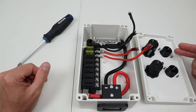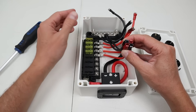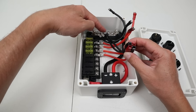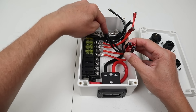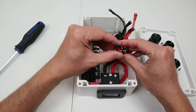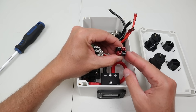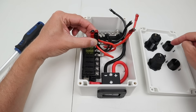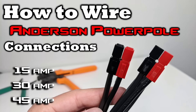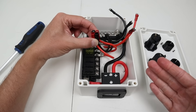I've finished setting up my first pair of Anderson PowerPole connections, designed for 20 amps using 12-gauge wire. I've added two positives with 20-amp fuses and two negatives off the bus bar. Because space is tight, I'm using a larger ring terminal and crimping both negatives into one connection to save space. You want to orient these a specific way to avoid reverse polarity. These slide straight up into position and a screw locks them in place. It's nice to have two 20-amp connections to your battery.